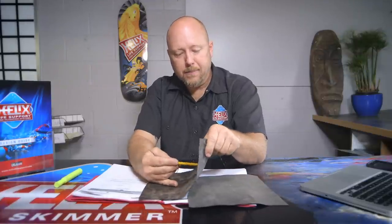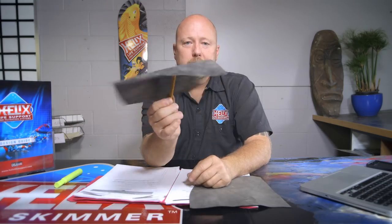You're going to do the same penetrations and mechanical seal applications on both. For puncture resistance — I used a pencil and didn't push through the EPDM that hard. They talk about tensile strength in the specs, but either way, a pencil can puncture both liners, so I don't think there's really a contest there — it's about application. If you get a hole in the RPE, you can heat weld it in the field or use a special tape to seal it. With the EPDM, you put a tape, a patch, and a primer on it — the primer melts the two pieces slightly so they bond together.